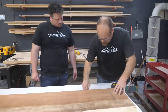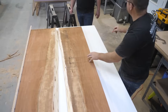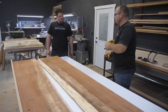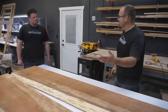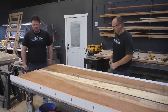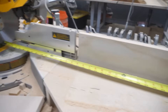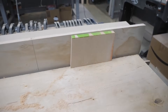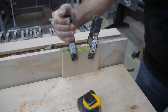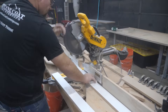I'm just going to trace my edge because this is where my next board needs to be. I'm going to cut two pieces at 36 inches exactly — that makes my boards perfect. I'll put my stop block right here at 36 and just clamp that, so I get two pieces exactly the same. I love the tried and true method of stop blocks because it creates perfect repeatable cuts every time.